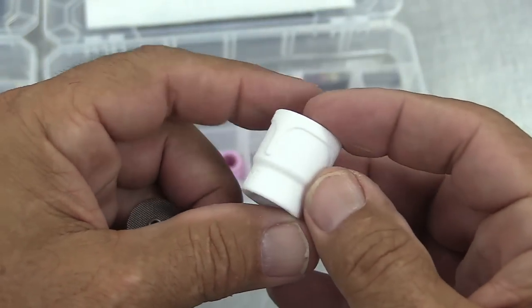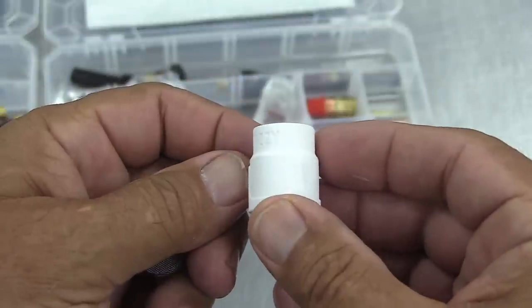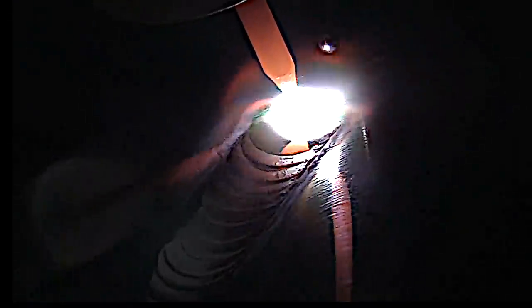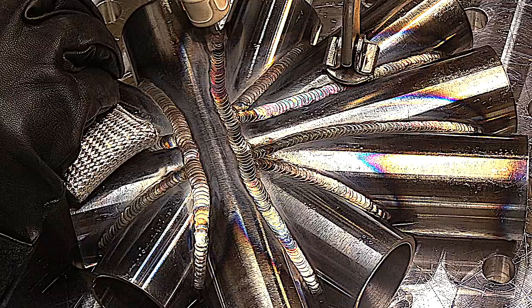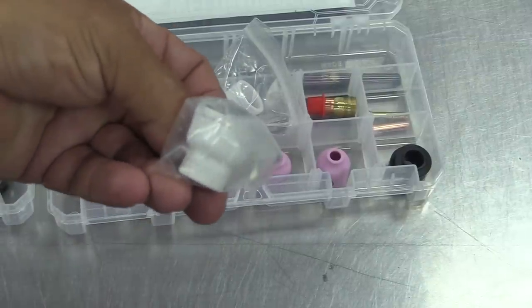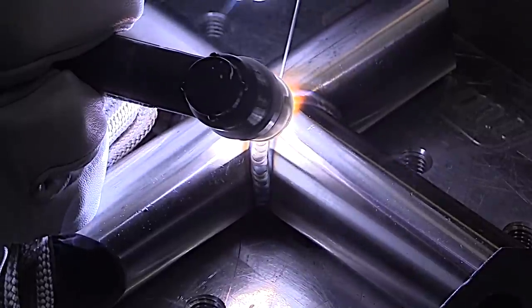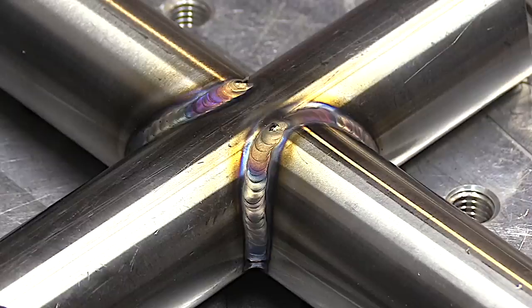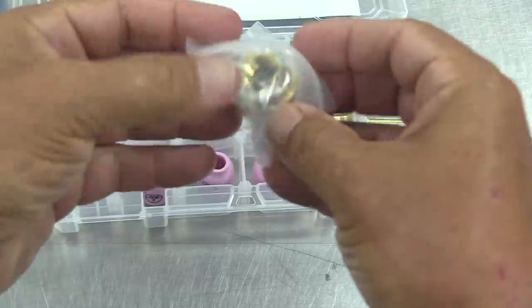The ceramic Jazzy 10 is a DC cup — great for stainless steel, chromoly, carbon steel, tool steel, even some light titanium work. This is some 4130 chromoly and this is the second pass. I'm doing a little pedal pumping here, but another benefit of a cup like this is if you get a really good shielded first pass the second pass just goes in a whole lot better. If you need a little bit more shielding with a little longer stick out, the ceramic 12 is a good choice. With stainless steel, a little tip: you want to get that puddle started quickly and get moving quickly to kind of outrun the heat. You don't always want to weld with less amperage — sometimes hotter and faster is better.